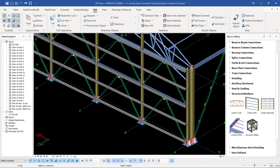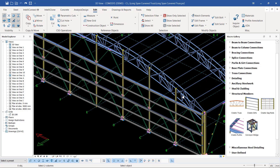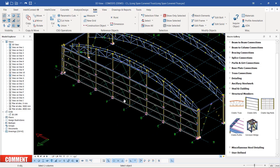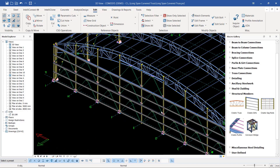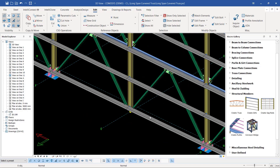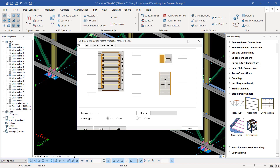The reason they're being ignored is that the heights are not the same — the height starts varying from this far end to that far end, which is why distributing or populating the cladding rails all the way to the top has been ignored. We'll do that manually. I'll right-click to terminate that command, right-click once again and click interrupt. You can see the first one has started very close to the base plate, so we want to adjust it slightly up. I'll select the cladding rail, then type the letter M and press Enter.